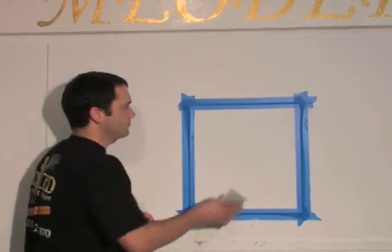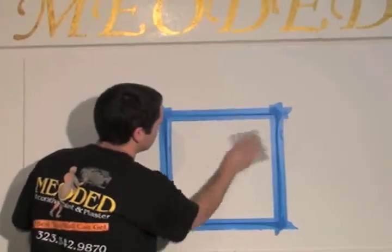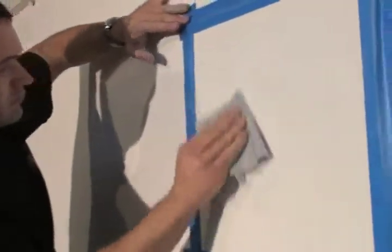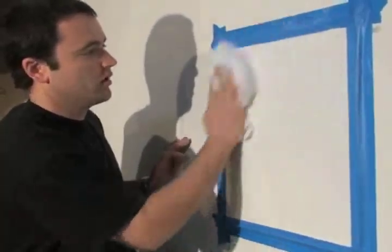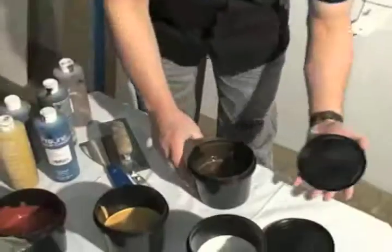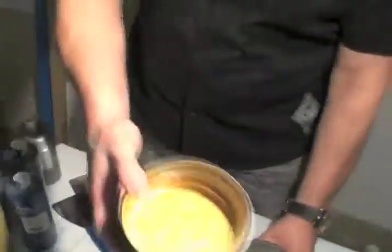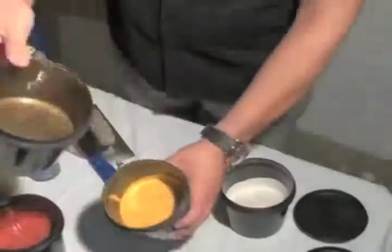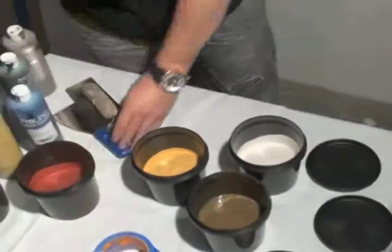After the second coat is fully dry, evenly sand the surface with 220 grit sandpaper for a very smooth base, so you don't get any undesirable textures in the final finish. Once sanding is complete, remove all dust before applying Pearlas Velvet. Look at these beautiful base colors of Pearlas Velvet with white, gold, bronze, red, and silver. You can create almost any color in the spectrum.